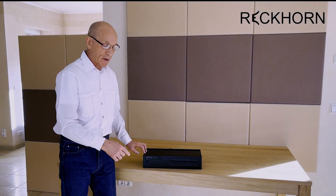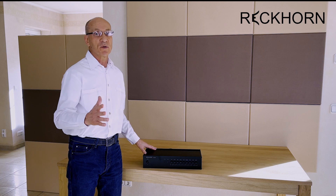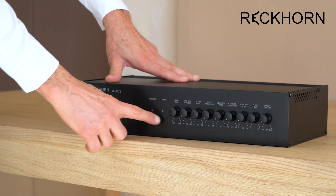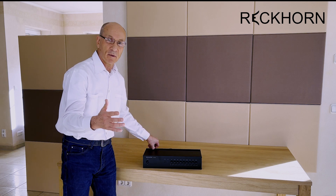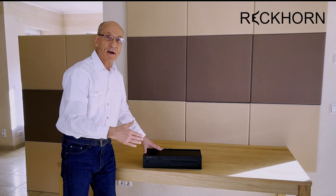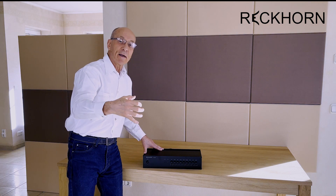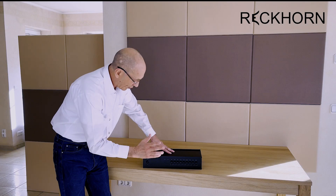The power switch is a hard switch — it's always on or off, no standby function, because we don't want to consume five or six watts overnight or just to let it warm up. There are two LEDs: one is 'protect,' which means there's a short circuit, over power, or any other problem with the amp. The 'clipping' LED shows you're reaching the limit of what the amplifier can do — if it blinks occasionally it's still okay, but if it's on steadily you have to reduce the level.